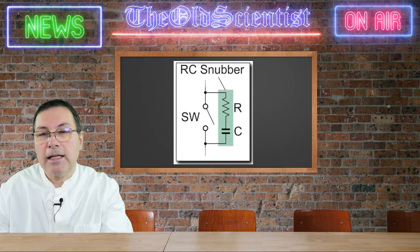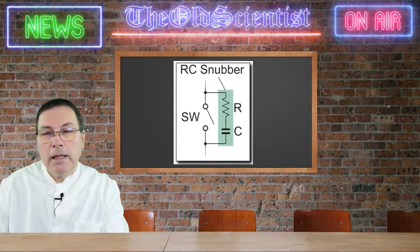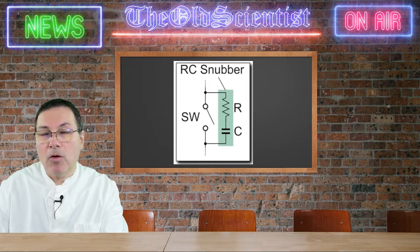We have all been there and paid the price of not being careful in our design. Yes, it adds costs, but compared to replacing new MOSFETs, these costs are very small. Most of the time only a Zener diode is used on the gate to restrict the voltage from climbing above the rated voltage. That does not solve the problem — it is only clamping down the voltage.